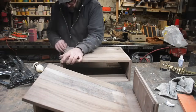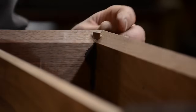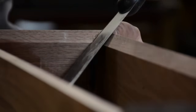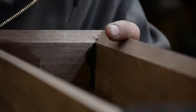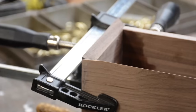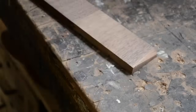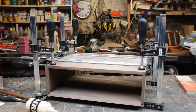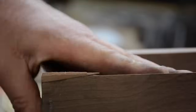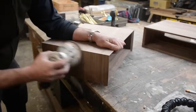This is the bottom of the drawer, and this is all solid walnut. I wanted the bottom to be the same configuration of walnut so that if this tube of wood breathes, it all breathes the same way. There I'm just feathering the spline in — it looks kind of nice, the spline on that V. And here I have a chip — I lost a piece, so I have to splice in a little chip. I try to find something of similar color from the scrap wood. The next morning after letting it dry, I worked it in, and to the untrained eye it just looks like a little piece of natural light wood.